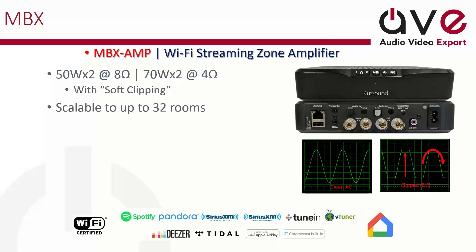You're scalable up to 32 different rooms or zones — really what you're doing here is devices. If you had two MBX Amps in the same room, think of that as one device — you can group them permanently, no problem, but that would reduce your count by one. 32 is still quite a bit. You can also use the MBX Pre and then bus into the D850 — an eight-channel 50-watt dedicated amplifier — so you've got one MBX Pre powering all of that, and you don't have to sacrifice any of that 32-device limit.